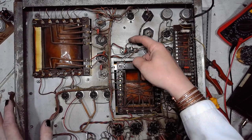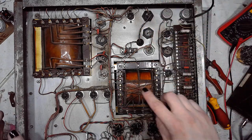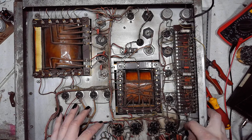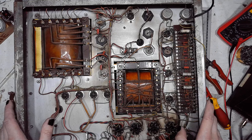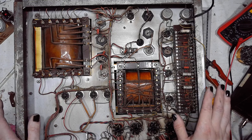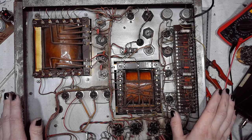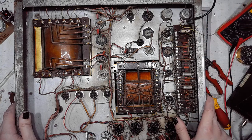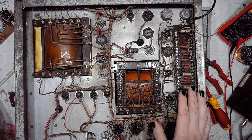Here we have a bias rectifier, and the bias potentiometers right here. There is a certain design drawback on how the bias is done on those potentiometers. If the wiper of the pot loses contact with the track, then the tubes lose their bias altogether, and like Steffi from the Skunky Designs channel says, they can go nuclear. This kills the tubes, so I will be doing the mod that I also knew back in 2000s